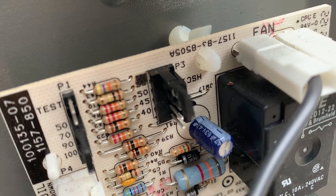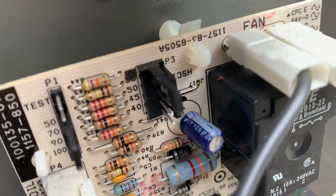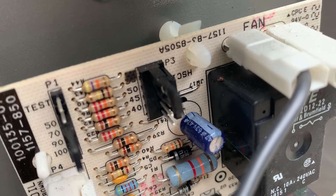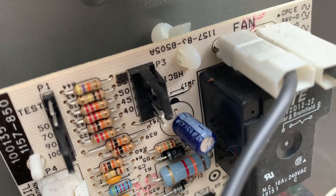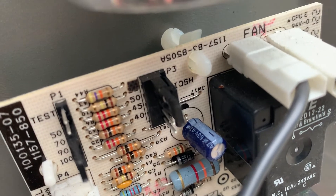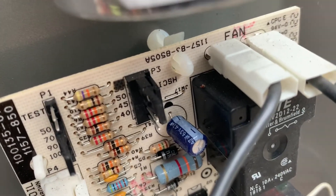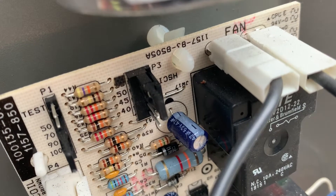Let me tell you what that is all about. If I set it, for example, where it's at right now on 55, what essentially that means is five degrees above what they set it for, you will not get second stage operation in heating only.